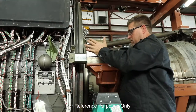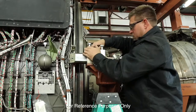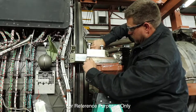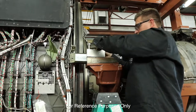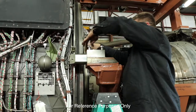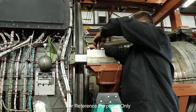At this time we're going to set the clamshell for the front head and start the center bolt, which requires an inch-and-a-half socket. The gap between the clamshell on the top must be perfectly level. By looking at it right now, it means the front of the engine needs to come down just a hair. He just lowered it a little bit. All these bolts should go in by hand relatively easily. If they do not, that means you are not level — you may have to do one head at a time.